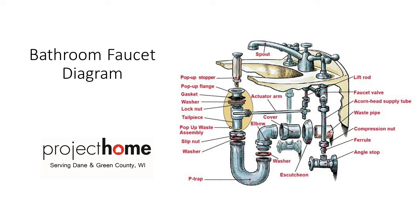Your bathroom faucet diagram. What if something like a chrome P-trap cracked and started leaking — I've had to rip the whole thing out. Where it comes out the wall, whether plastic or galvanized, I'd have to make adjustments to convert to PVC. PVC will last forever. Those chrome P-traps will not. If you have a chrome P-trap, keep an eye on it — years down the road they get brittle, start cracking, and eventually get holes in them.